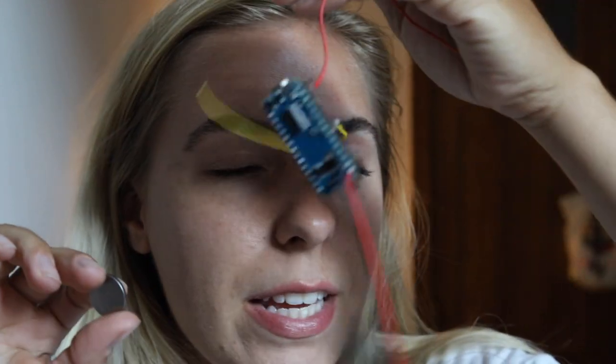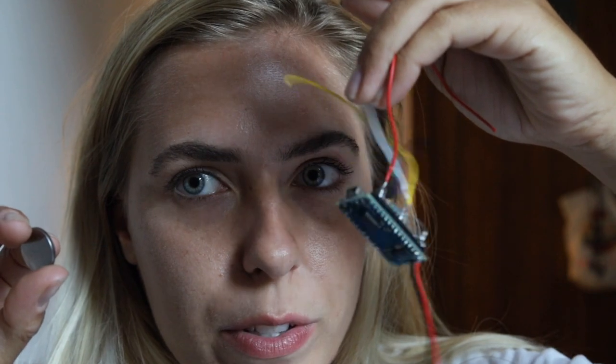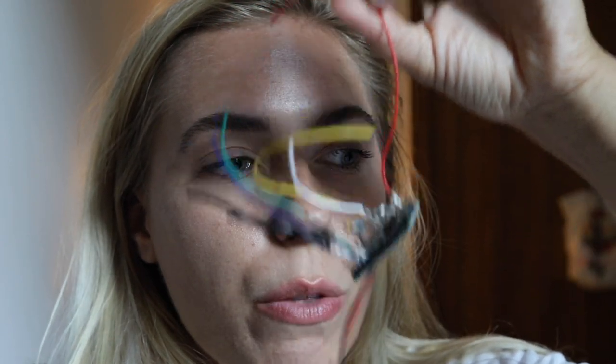But if it's below 5 volts and it's around 3.3 volts, which is what this is running at, it's running at 3 volts. So when this isn't providing 5 volts and it's off, but this is still on because it has a backup power of 3 volts from this battery, it will just enable the clock. So my plan to use the 3.3 volts here apparently won't work because you need 5 volts on this RTC module in order to take a measurement, reading and writing.